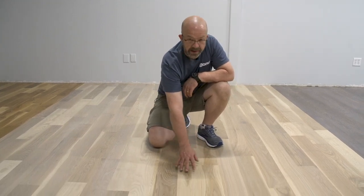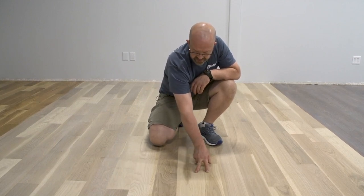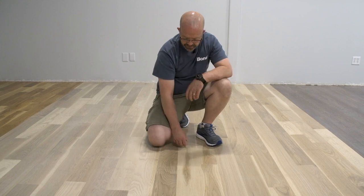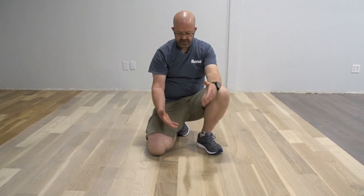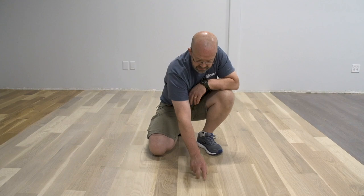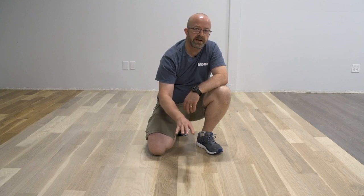This is the area where we left our T-bar mark out into the floor. We sanded and scraped this area back down but left the heavy mark on the other side. It's really hard to find that mark now, and where we scraped it down it looks fine — much less discernible for the homeowner. But over where we didn't take that heavy mark down it's still there and it jumps out. The note is: after you put your sealer down, look for any heavy marks and try to take those down right then — don't wait until you abrade because then they're a lot harder to find.